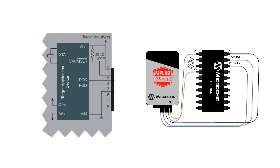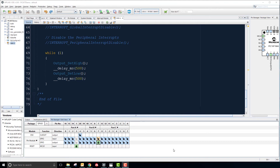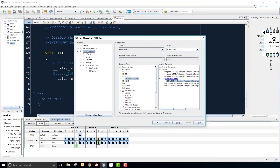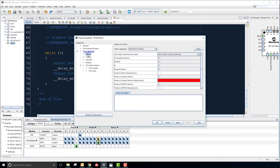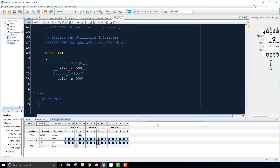These are all of the connections that are needed, so I can open MPLAB X and program the device. My project is configured so that pin 10 of my PIC MCU is set up as a target pin, which toggles on and off every 500 milliseconds. I would like to use my PIC Kit to power my device. To do this, click the dropdown menu next to the Build Project button and click Customize. Next, click PK4 under the Categories pane in the left-hand window. Then click the Options Category dropdown and select Power. Finally, check the Power Target Circuit from PIC Kit 4 checkbox. This now means that the PIC Kit 4 will supply the voltage level specified in the voltage level field to your target device. If you do not enable this, an external power supply will be needed for your device, or else the PIC Kit 4 will not be able to program it. Click Apply, then OK to save these changes. This is all that we need for our setup, so I can now click the Make and Program Device button.